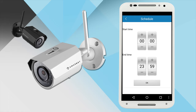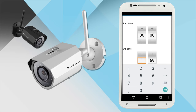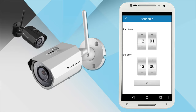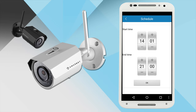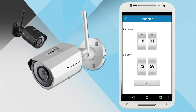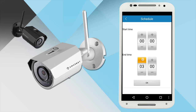Say for example, you have a camera at your business and you take a 1-hour lunch every day, and you want separate recordings for your morning shift, lunch hour, and afternoon shift. In this case, you can have recording number 1 set to 6 am until lunch starts at 12 noon. Recording number 2 can be set at 12 o'clock and 1 minute until the end of lunch at 1300 hours, or 1 p.m. Please note, the times here are shown in a 24-hour time format, but can be changed to 12 hour. Finally, recording number 3 will be from 1300 hours and 1 minute until the end of the afternoon shift at 1800 hours, or 6 p.m. Also, if you want an after hours or overnight recording to record past midnight, you can set recording number 4 from 1800 hours and 1 minute until 23 hours 59 minutes and 59 seconds, and then recording number 5 to start at midnight, or 0-hundred hours, until the following morning shift at 6 am.